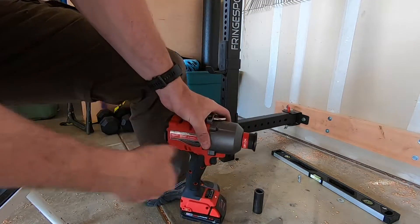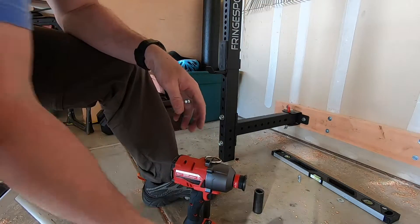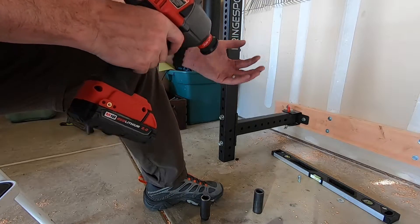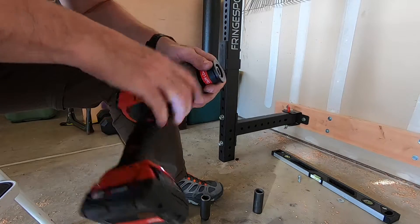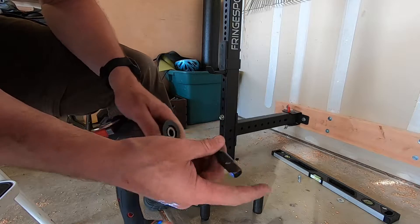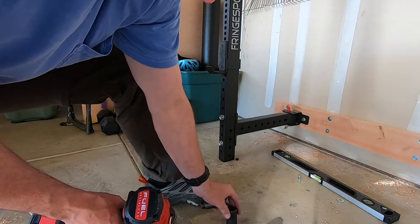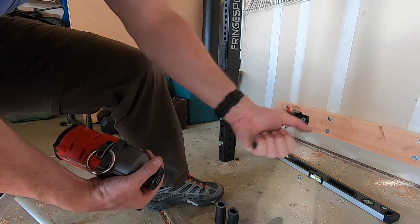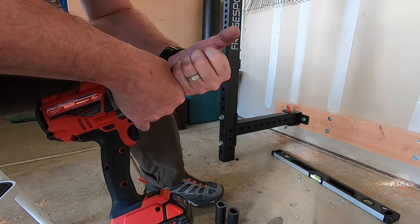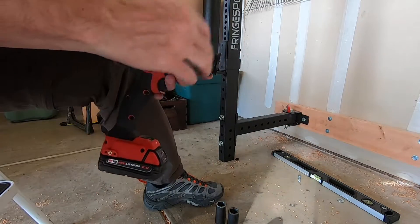One thing I did not think I was going to like — it doesn't have a standard anvil. It's got this 7/16 quick lock, which is like your smaller quick locks but clearly a lot bigger. I didn't think I was going to like it because with larger bolts I like to just pop it on, pop it off. But I love it. I fell in love with it the first time I used it because you can buy these little anvils — this is a Proto 7/16 hex half-inch anvil that just drops right in there. Now I can do any of my larger bolts. And I also have the option to quick disconnect and drop one of my big bits in there — if I need to drill a hole through a stud, I can drop my auger bit on and drive right through, then pop my bolt on and drive my large bolt through the stud or beam.